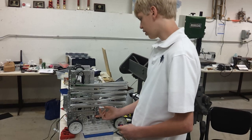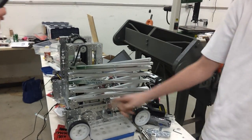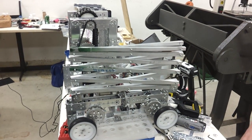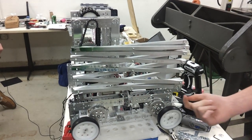Basically our idea is a lead screw hooked up to a motor. It's geared up for a little bit more torque. This lead screw has about four threads per inch, so for each rotation on this lead screw, our basic design moves forward a quarter inch.